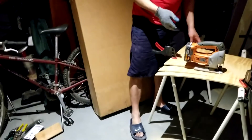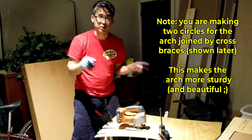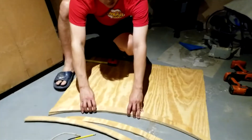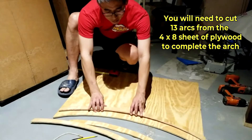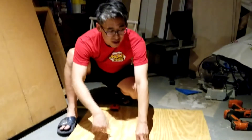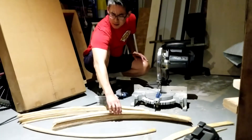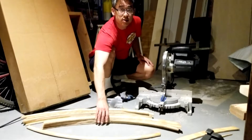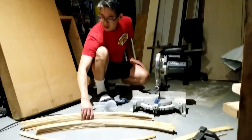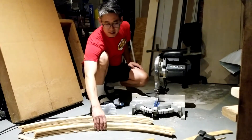For a four-by-eight sheet of plywood you generally need about six chord pieces to make one circle. Once you have a good piece as a master, use it like a ruler to mark off the next pieces — trace the arc and move it up to trace another. A compass is probably more accurate but this is faster. We cut about 13 pieces total; sort them by thickness into uniform stacks — some skinnier, some thicker.